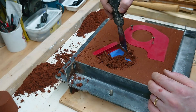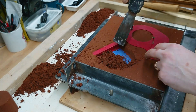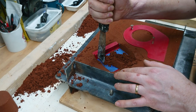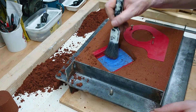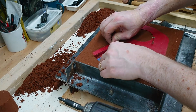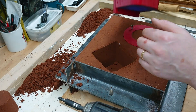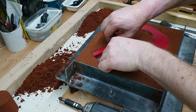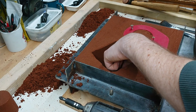Because this mould pattern wasn't optimised for the open mould approach, I had to do a bit of digging to reveal it. One drawback of 3D printed patterns is that if you don't sand them down well enough — which I didn't — the layer lines can snag on the sand. So when you come to pull them out, there's a bit of a break-out as it pulls out. There was a break-out in the base of the pattern, so I had to shove it back in, give it a good push down and a wiggle, and then try again. It wasn't so bad the second time, so I just tidied up with my finger.